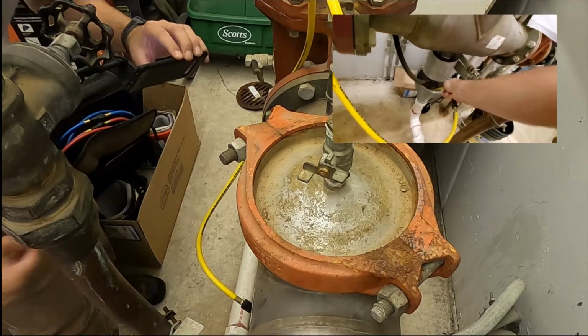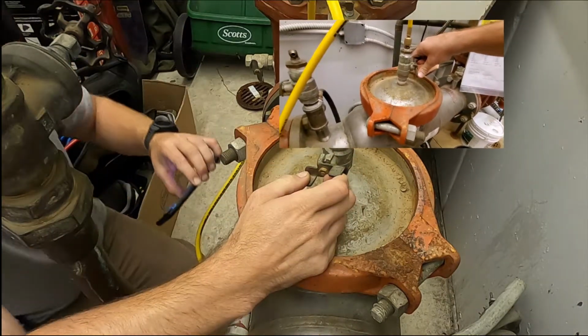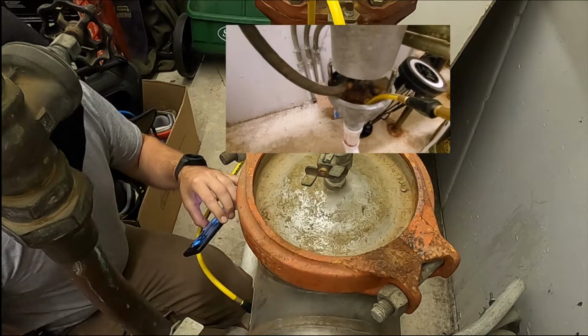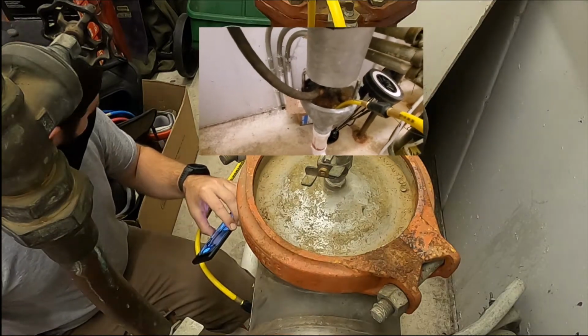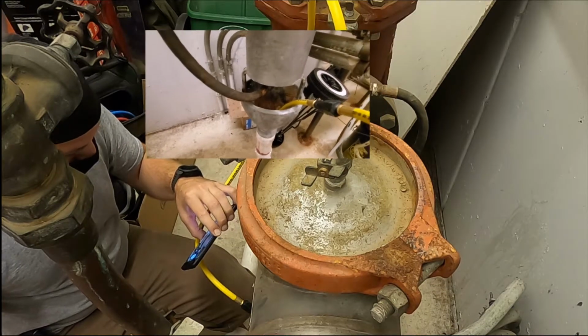The fire panel called out and both the main valves shut off. I start by opening up the test ports. You will see once I get both test ports open, it will cause the relief to dump. This will get all the water to the inside and make sure that your pressure is relieved when you open it.